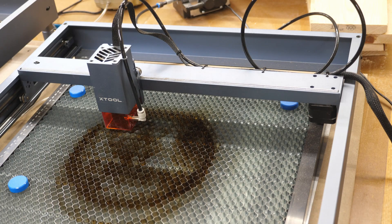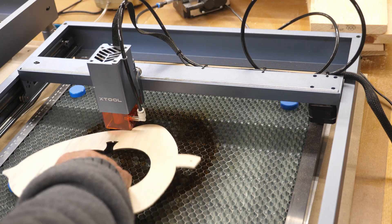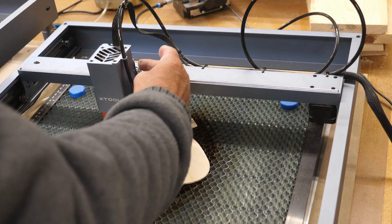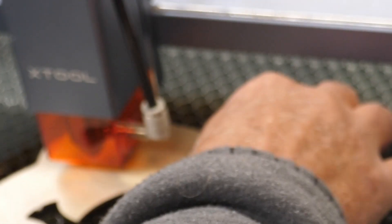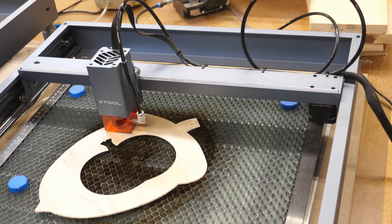One of the features of this laser that I really like, and I wish everybody did it, is the ease of focus. Normally you've got some little tool — a cylinder or a plate — you have to put between the laser head and the bed. This has a little kickstand. I'll take this scrap of two-mil plywood — let's say we're going to cut it. To focus this, there's a little kickstand back here. You just drop it down, then there's a little thumb screw over here — you let that drop down, lock it back down, fold the kickstand back up, and you're focused and ready to cut. You're not going to lose the focus piece. That's a big problem with little cylinders or flat acrylic plates — they're very easy to misplace. This is self-storing. I like that.